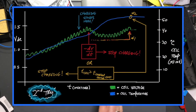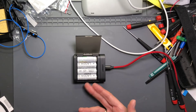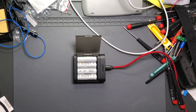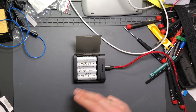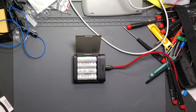This is especially true when charging at a lower current setting. This Ugreen charger operates at 600 milliamps, which is lower compared to other chargers that hit cells with two amps, 2.5 amps, or up to three amps. At high current it would hit the cell really hard, and you'd definitely see that voltage curve come back where the cell says it's not going to take any more charge — giving you a more decisive cutoff.